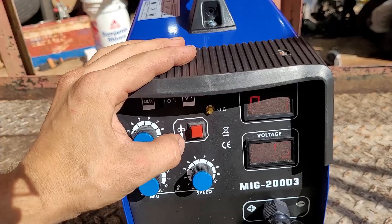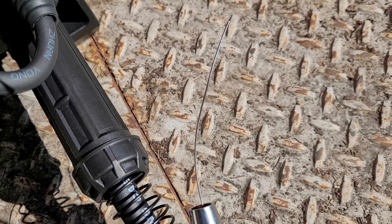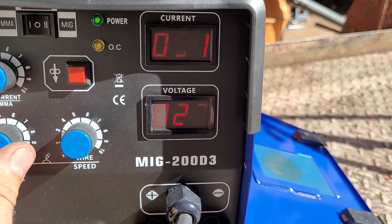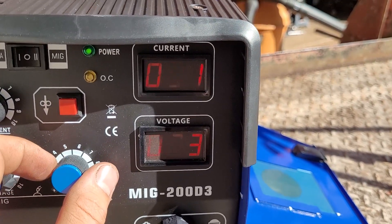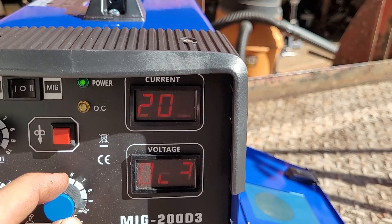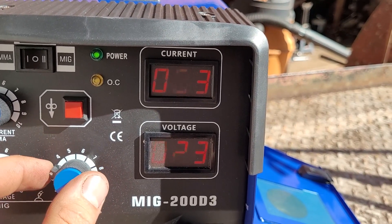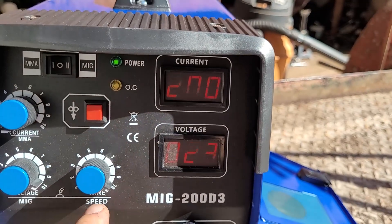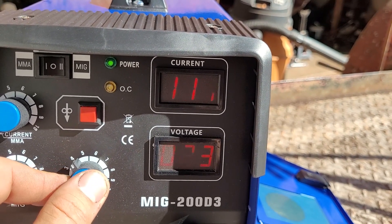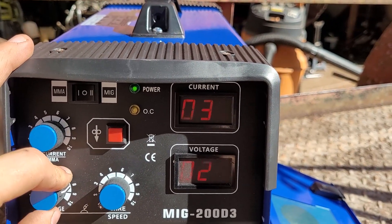Current, voltage. You got this little switch right here to get the wire to start moving. The fan's a little loud — that's just going to have to be what it is. We got the MIG voltage right here, starts at 15 and goes up to 23. And then we get the wire feed speed here — apparently that reads the current. So the wire speed and the current are tied together on MIG. You can see it goes to 200 — they're locked together. So you're doing 200 amps worth of welding and it pushes out that much wire at the right speed. You can't control them separately, which kind of stinks, but let's give this thing a test.